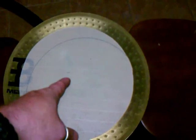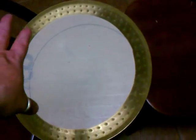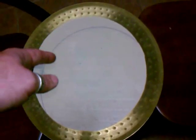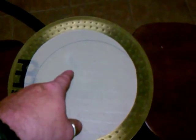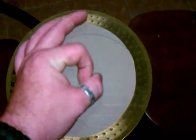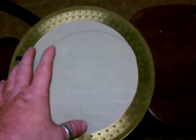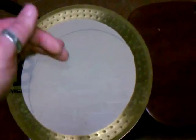Now, as you get towards the inside, you want to be really careful and go really slow, because the bell is so deep, it takes a lot more forming. And the trick here is if you heat the middle of the cymbal too much, then the actual top of the bell will hit your hole, the little mounting hole where your vacuum is being pulled through, and cut off your vacuum before the rest of the cymbal's shaped, and then you're done. You're not able to get those bumps out because you have no more vacuum. So we're going to go and move into heating now.